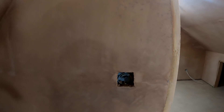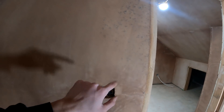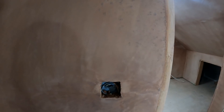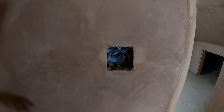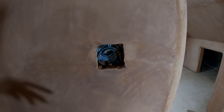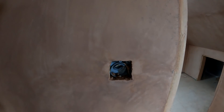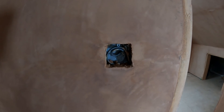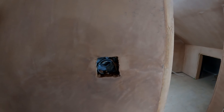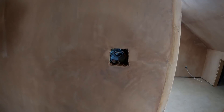While Nick's just doing some other things, I'm going to make off this switch here, which is a three-core cable - a switch cable towards the pendant in this bedroom. I'm not going to film all of this as you've seen it in the previous video: clean up the back box, strip the cable, and when I've sleeved up the cable I'll explain what each cable's doing. I'm also going to earth the back box.